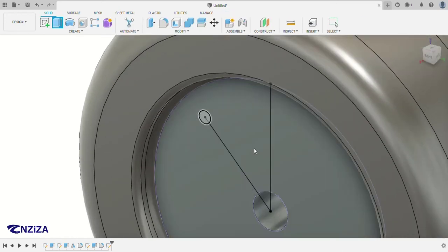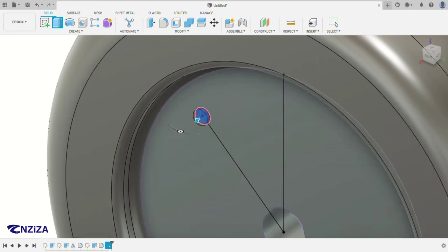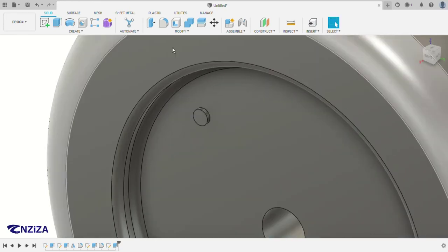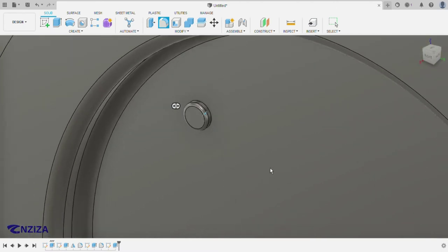So this one will be extruded, but with the join command, the join operation. So the join operation, I'm going to extrude it by 5 millimeters only. Okay, and then we're going to use some fillets to fillet it that is 2 millimeters. Okay, so